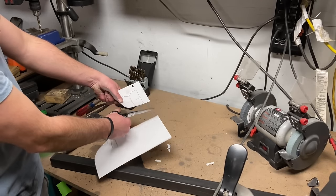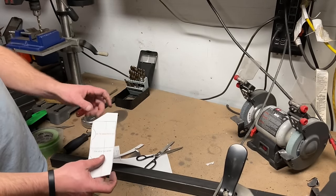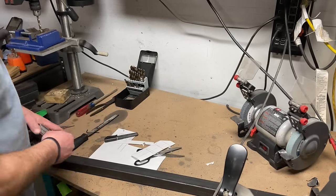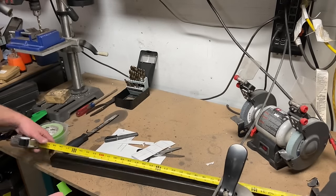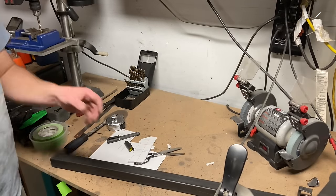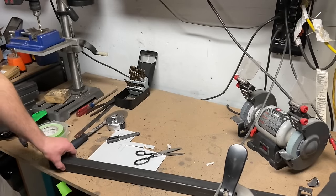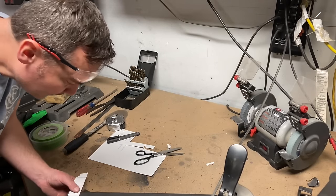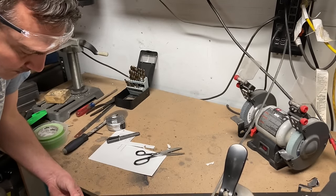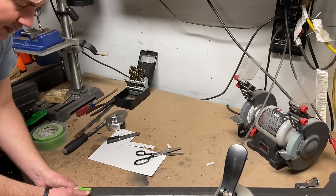Now you don't really have to stick to the lines because you're going to wrap this around the metal. You're going to cut the metal and it will obviously cut the paper. I leave a little tail on it — it makes it easier to tape. Just follow the directions on it. 38 and 7/8 to the end. Then you're going to line up this blue line with center. Take it and fold it right on the red line. Line up the blue and the red with the marks made on the tube. Wrap it around and tape it right to the tube.